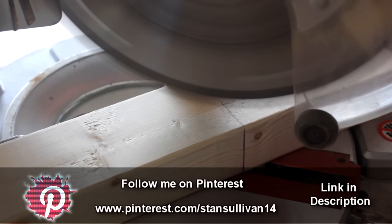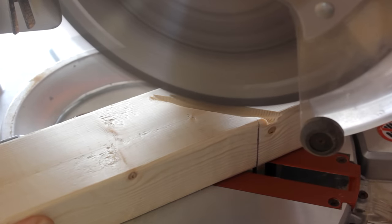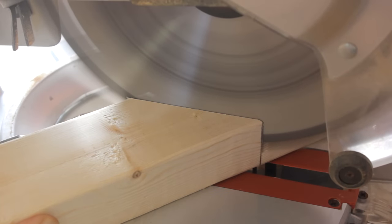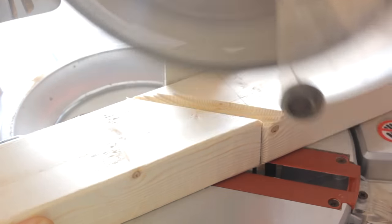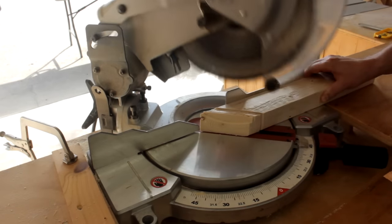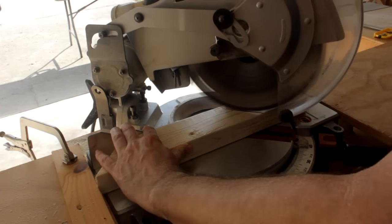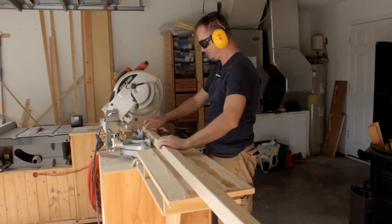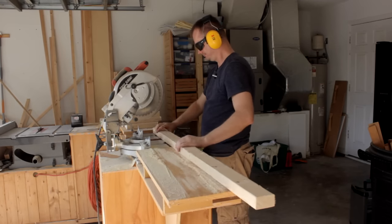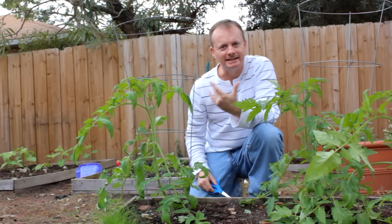I never try to hit that second cut dead on first try — I always sneak up on it. Once I am satisfied with where that cut is going to go, I will often set a stop block and then finish it up. That is because if I need more than one board with the same angles at the same length, I can just keep flipping the board over to make each subsequent cut. With the stop block in place I know all my boards are going to be right in terms of length. And that is all I do to make simple and easy angled cuts.